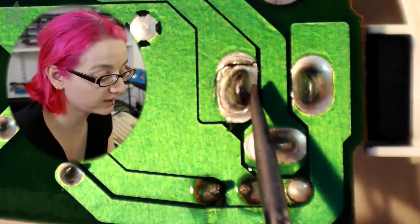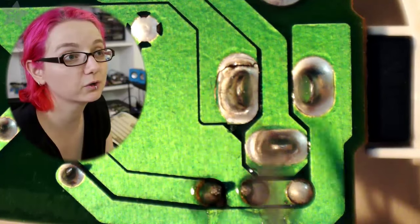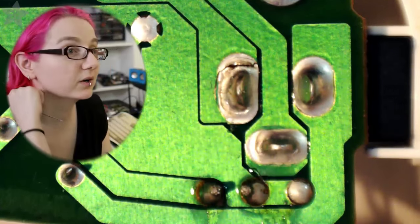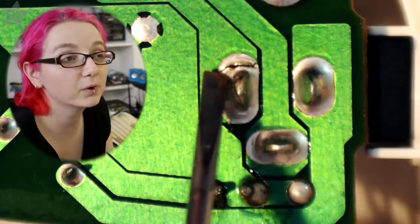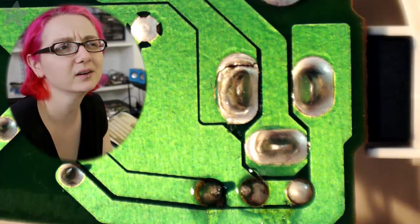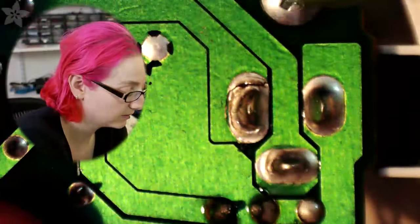Basically, either something was plugged into the DC jack and it fell, or the DC jack was plugged in and it was strained, and this is the farthest corner. So these weren't flexed as much, but because the jack was flexed up and down a little bit, this here just cracked. I kind of imagine that when you go to the dentist and they see a cavity, this is kind of what it looks like. It's just a little crack, but once you know what to look for, you see it. And you see it goes all the way around. So this is a flaky connection. And that's why sometimes you plug in the DC jack and it's working, and sometimes, depending on how it's tweaked, it won't work. But I'm actually going to take this apart too, because I want to show the rest of this.